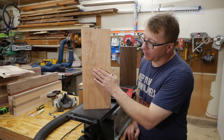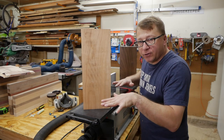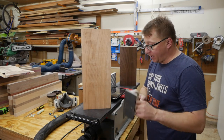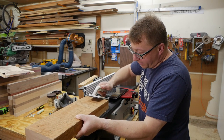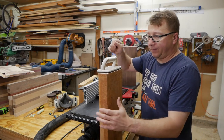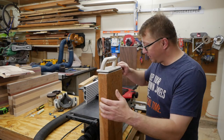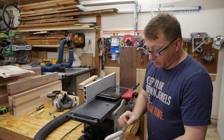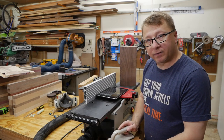Although the jointer is doing a great job getting it nice and smooth, I don't know if you saw when I was pushing — a lot of extra energy I had to push with these really wide boards. In fact, I actually had to take the paddle and stick it on the end, kind of dig the paddle into the end and push down. I find that a little disconcerting when using the jointer. I feel like I might slip and push my hand into the cutting blade. I know I can make a different handle with a little hook on the end to keep that pressure down and forward at all times, but it's still a lot of energy to push it through.